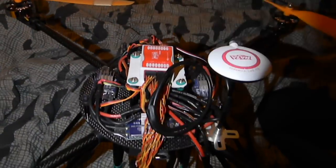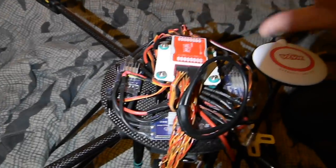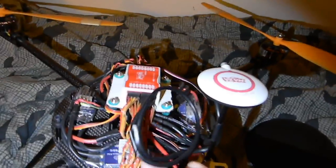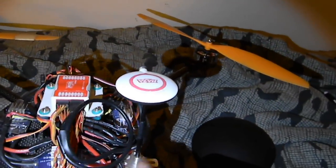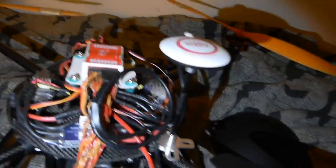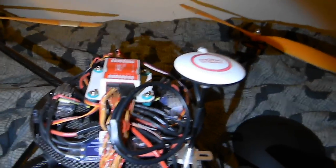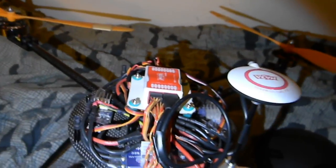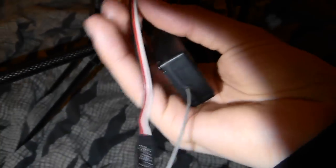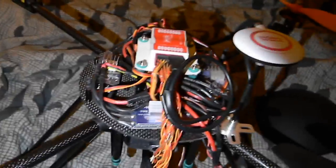From the center of gravity, my GPS setup is 6 centimeters back, 6 centimeters to the side, and I think 10 centimeters up. They give you a really long cord which is kind of crazy given how short the Naza's carbon fiber GPS pole is — unlike the Wookong which gives you three different sizes. I just bundled the cord up and put it underneath. This also connects to my shutter for my camera and my gimbal from the flight controller.